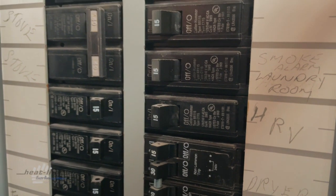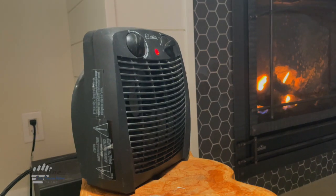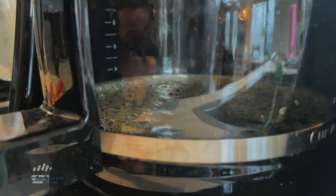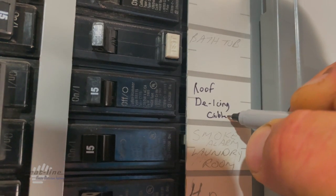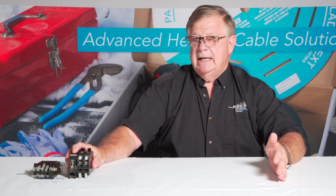The reason we like to see dedicated outlets and dedicated circuits is because freeze protection is something that we don't want interference with. We don't want lighting and other heating appliances on the circuit with the freeze protection, because they may inadvertently put too much load on the circuit and trip it out. With a dedicated circuit, there would be no nuisance tripping problems and no interference from other appliances or loads on that circuit.